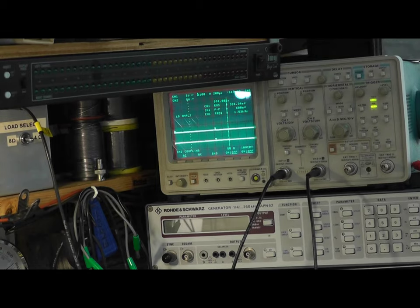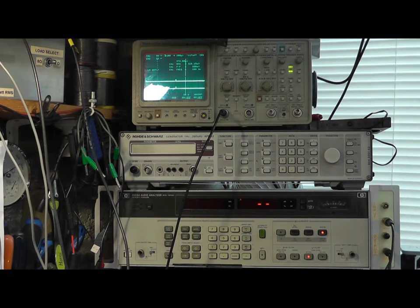on the audio analyzer. Right, so let's do a total harmonic distortion test on it. So we're looking at the right hand channel first, and this will be the display here, which should display our total harmonic distortion. If you look at the scope, we'll just take it just before clipping and then we'll measure the distortion. Don't want to run it too long, I don't want to stress this amplifier. So let's run it up, just back off clipping, 0.22%. Pretty acceptable for a valve amplifier, very good actually.